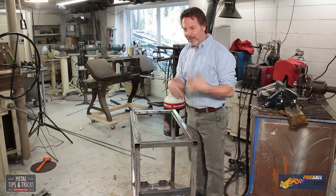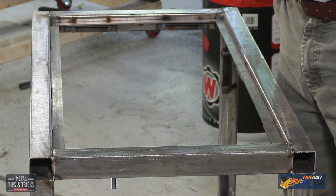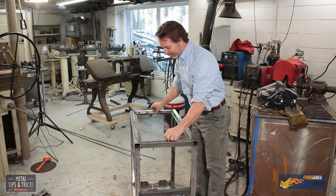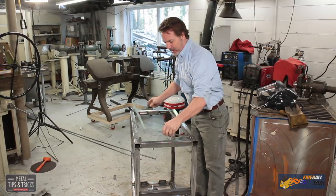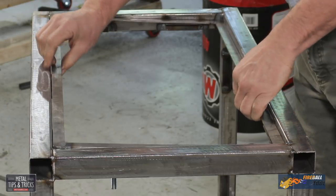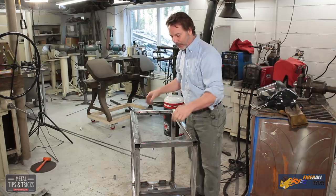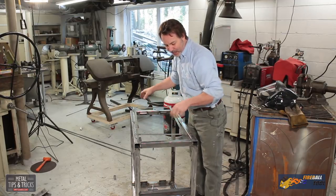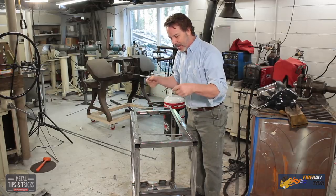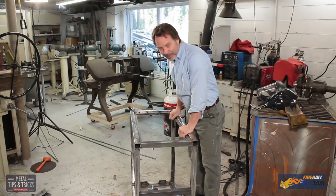So there is square, machinist square, and then there's fabrication square. And this is definitely an amazing fit for fabrication, because I could take this frame, flip it around, and it fits in every direction. But for me to fabricate this my old way, what I would have done was put my frame pieces in here and weld it to it in place, but it could only fit in one direction. Now, let's cut out and put the panels in here.